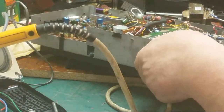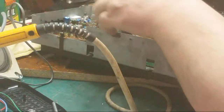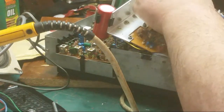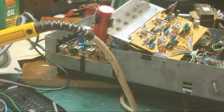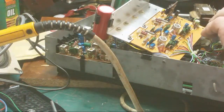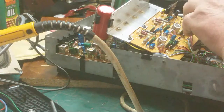So you test it from the other side, might be easier. Right. There we go. There's that little diode. Pull the cover off it. Let's test that, see if it's gone. Because whatever the problem is, pulling the voltage down, could even be a transistor, could have a transistor there. Or a regulator rather.